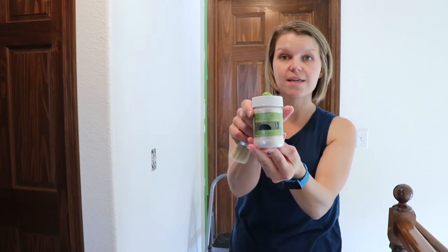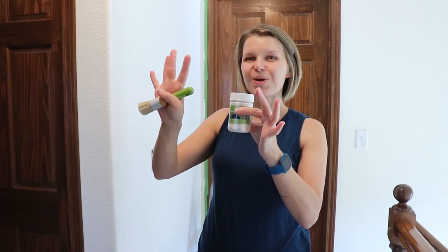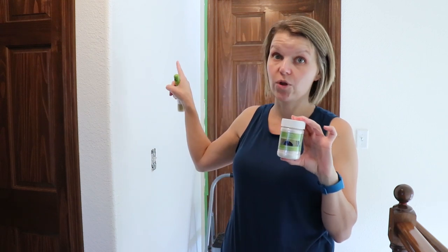Then we're going to need some paint and a brush. I am choosing this metallic paint — this is by Modern Masters, it's a metallic acrylic paint, water-based, and the color I chose is a pearl white. It is not going to be a really visible color on this wall. The effect I'm hoping for is that when you look at it maybe you can see it from different angles but not directly straight on. There isn't much of this — I did get a second container just in case — but when stenciling you need very, very little paint, so this is probably going to cover my full wall.